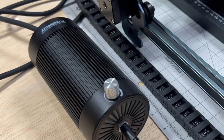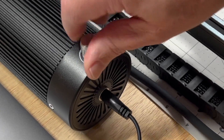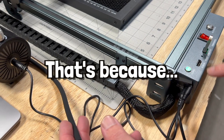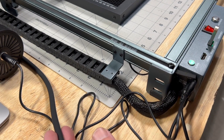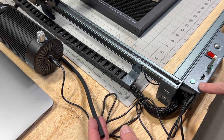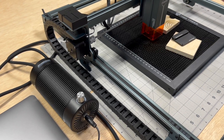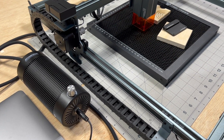It's zero strong. We have the machine on, we've turned the pump all the way up, and there's no airflow — it's not currently on. I believe that's because this output is actually controlled through LightBurn or your laser engraving software for the air assist. So really simple: turn air assist on in your settings so that the air pump only works when it's engraving, which means we don't have to turn this on and off like we've been used to with our other air pumps.